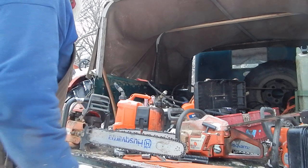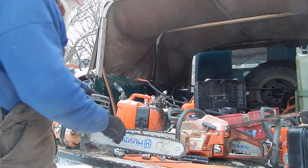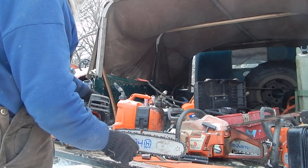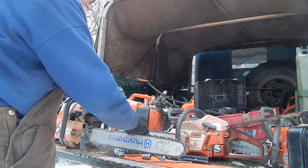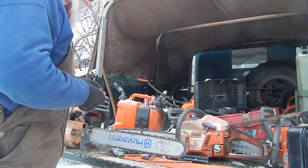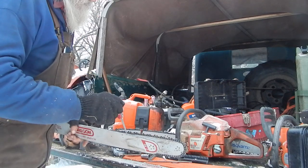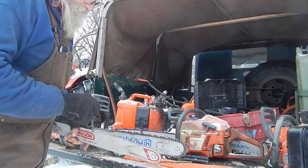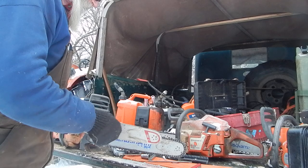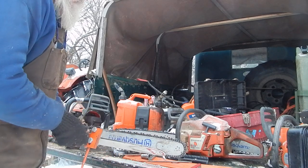There are times you're dealing with dirty wood and that'll take care of a chain in short order — it'll dull them fast. Speaking of that, this is my original bar that came on the saw. I get a lot of life out of bars — I run them for a long time because I just keep repairing and rebuilding them. This is supposed to be a 50. If you start getting a lot of play in there, that's where people complain their saw is cutting crooked. You need to push them back together, which is what this tool does — it runs on there and the bearings push that bar back together.